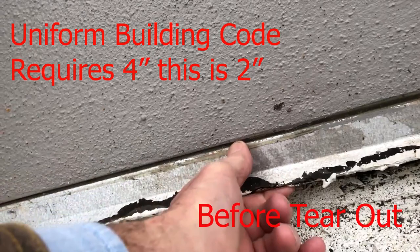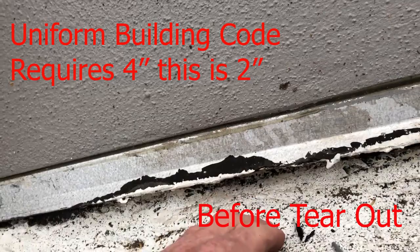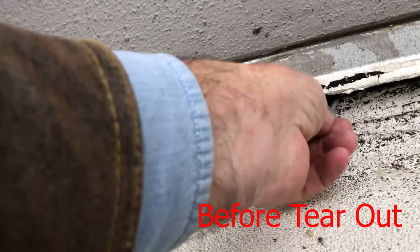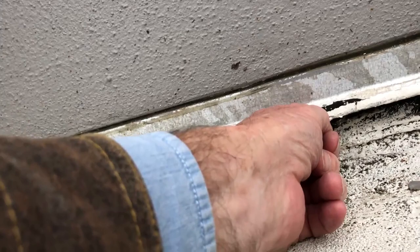You know, this is a very obvious problem. The roof membrane, this flashing, number one, is not really big enough. If you're going to use a small flashing like that, you better use an L flashing that you adhere your membrane to at the base and let that L flashing go all the way up. Here they've got the roof membrane only goes to right there. So water splashing, water dripping, water can get behind it on that area.